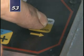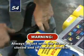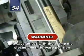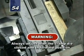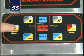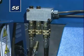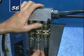Step 53: Depress closed clamp button on touch pad. Using four-spoke handle, bring pressure die forward slowly until it contacts material. Move an additional one-eighth turn. Step 55: Depress open clamp button on touch pad. Step 56: Reattach zero hose to distribution block.